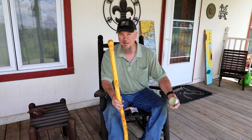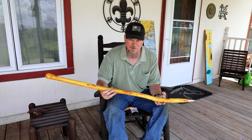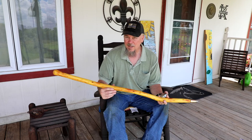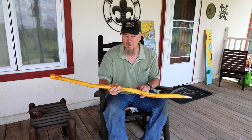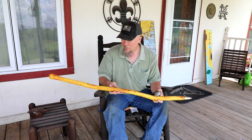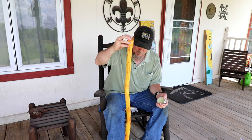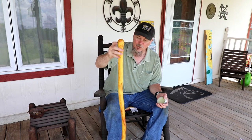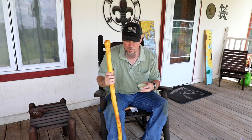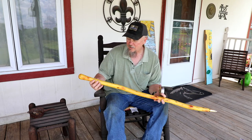I'm done now and I'm really pleased with the way this one turned out. This was essentially just a piece of discard from one of the blanks I used a couple years ago to make a stick — I figured what the heck, I'll give it a try. One thing I noticed starting out was that the belt sander would not knock down that secondary bark because it was just too hard and I didn't have a coarse enough belt — a little lesson learned. But once I got that off and started sanding, it really turned out nice. It is twisted, but it lines up pretty nice from head to toe, so it's going to make a pretty good walking stick. It has a few cracks, but what I've found over the years is the cracks usually stabilize. The final thing I'm going to do is treat it with some Burt's Bees hand salve — it shines the wood and really brings out the grain.